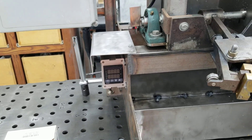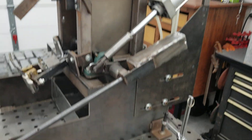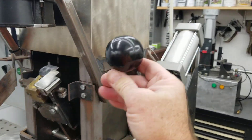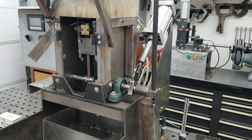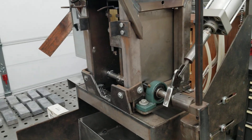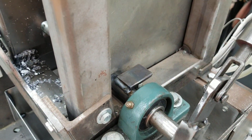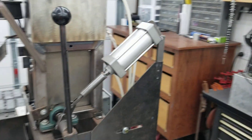One of the big issues with the machine is that the smaller cylinder that was on it moved the arm too abruptly. The arm would come up and bounce at the top of the stroke, which would throw off the counter and the indexing was bad when it would get up underneath the spouts. It also stressed the stop there and broke it off.